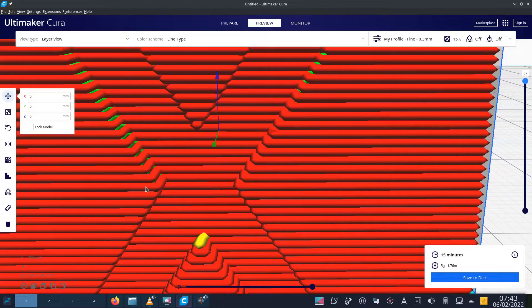There's a very simple, easy way to do that. You can just tell the printer to make some bleeps to alert you that that line has started, so you can pause the print. You could set it to do some bleeps on a line down here to give you some warning that this line is coming up, and then bleep again when it hits this line. You can put those tones in on any line you want, as many times as you want — a couple of layers back from the one you're actually going to change on, and then another bleep on the actual layer you want to pause on.